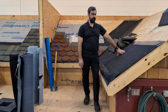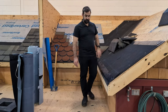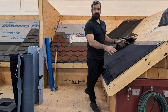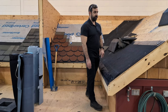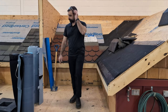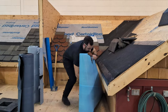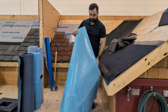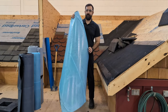That's about it for ice and water shield. Let's install a little piece. As mentioned, it's a split back release. We're going to install a piece — generally on a hot summer day it'll stick to the decking pretty easily. Here we have our piece with the split back release, which is split down the middle for ease of installation.